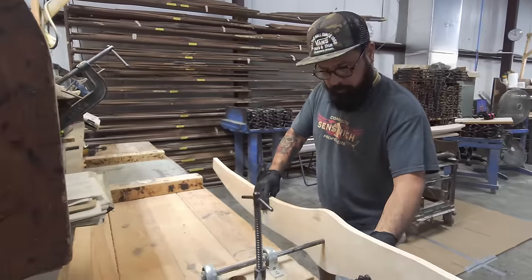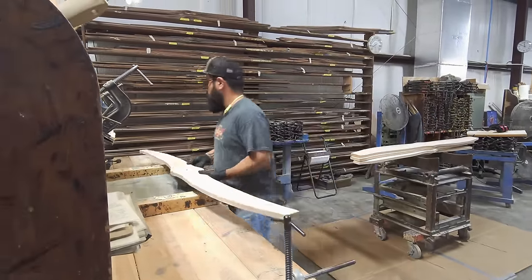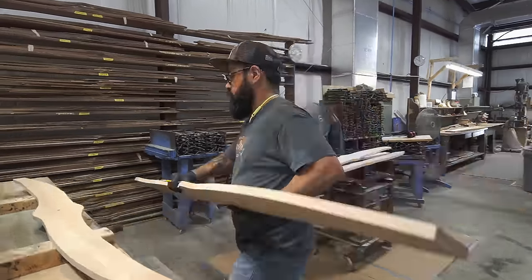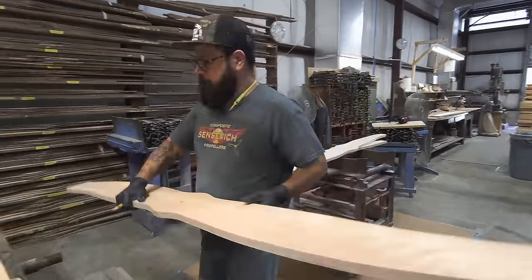It's insane. They start balancing the propeller before it's even a propeller with each layer, and he marks the side that's heavy so that the next side will be opposite of that to keep it in balance throughout the entire process.